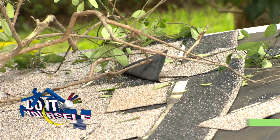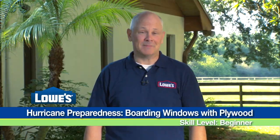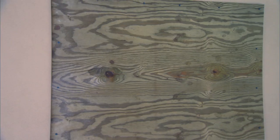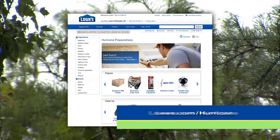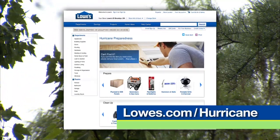When you live in an area at risk for hurricanes, you'll need to prep your home before the storm. Windows are especially vulnerable to damage from hurricanes, but you can protect them using plywood. Plywood is your least expensive option when it comes to boarding up windows. You could also use polycarbonate or metal storm panels — find out more about those installations at our hurricane preparedness website.